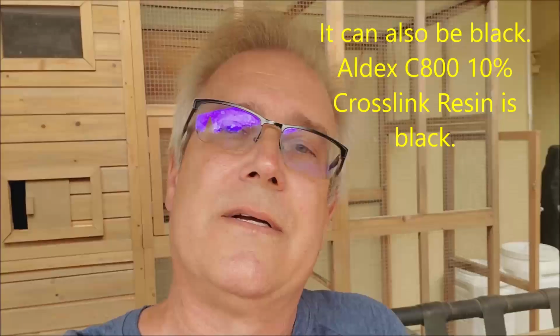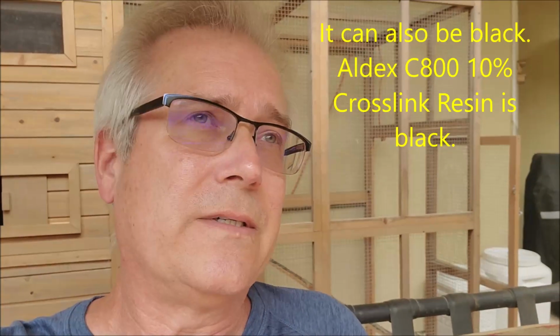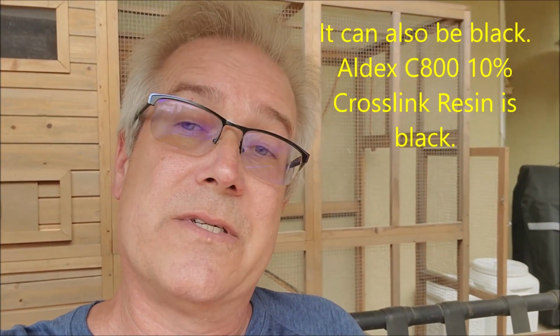Yeah, he has a water softener, and the resin filter basket broke, and resin made its way into the entire house plumbing and the water heater and every fixture. And it was just a nightmare. So I spent the next 2 days, total of 12 hours, trying to clear all of this stuff out.